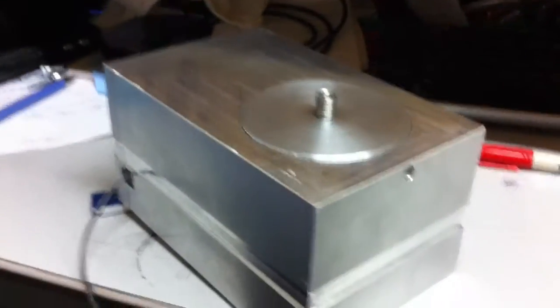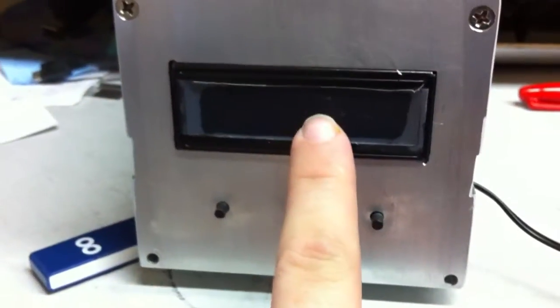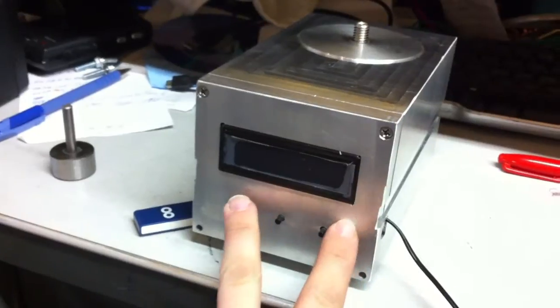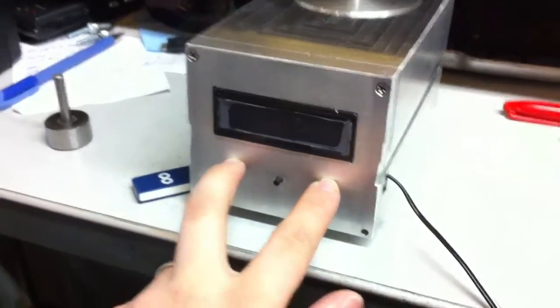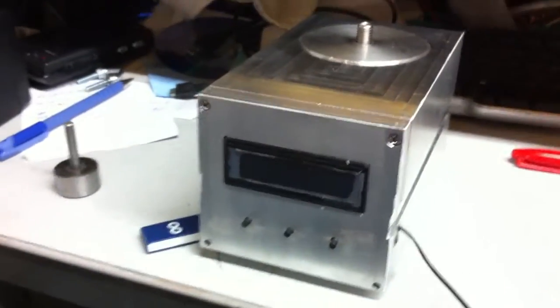When you're done, pull the key out and you're ready to run. It's built off an Arduino Nano with an EasyDriver stepper motor driver inside. There are three buttons on the face and a 16x2 LCD panel. It internally regulates voltage from the Anton Bauer 14.4 volts down to 12, so you'd need at least 12.5 volts — a little higher would be better — to get the regulator to work.